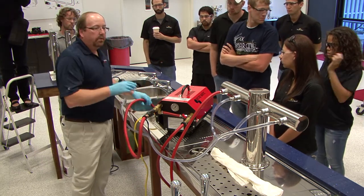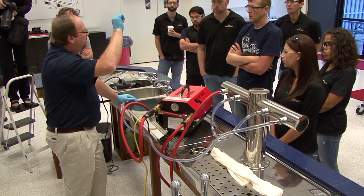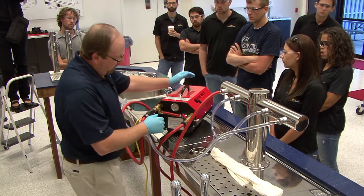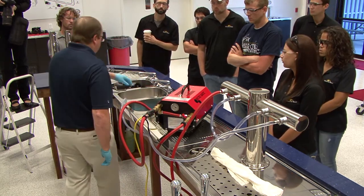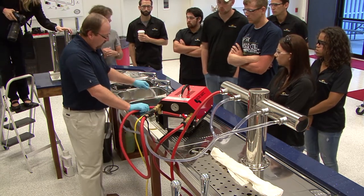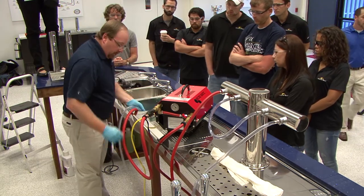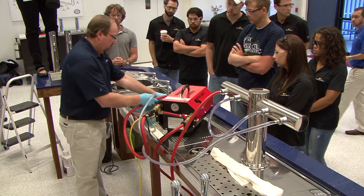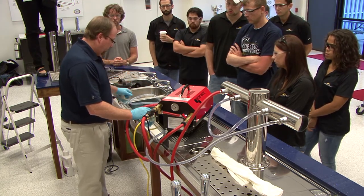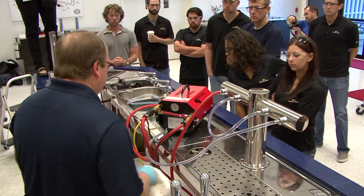We're all set to go. We already have all the lines full of water now. Once we get this solution working through the system, we're going to go back to the cooler and make sure our FOBs are bled full of solution, and also put a little bit of chemical out the drain mechanism on those FOBs. So we'll fire this back up and get her pumping again. Make sure we have a return — which we do. Now we're going to take that return and put it into the same sink as we're taking from. We want that first loop that goes through to be 100% chemical. As soon as we see that this turns blue, then we'll go back there and make sure our FOBs are bled clear.